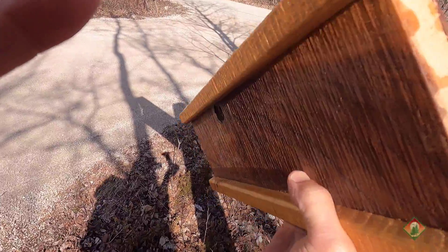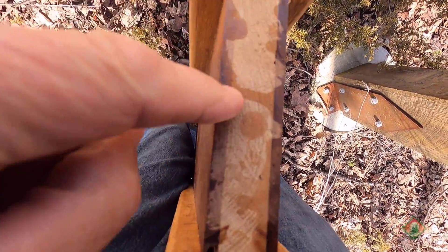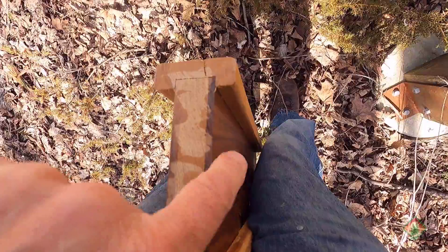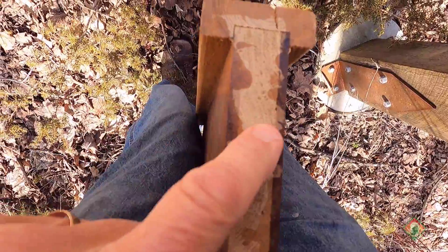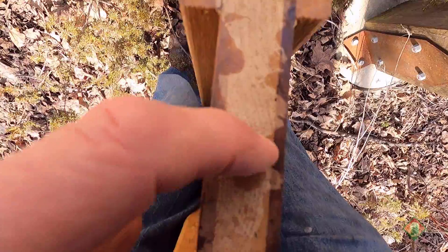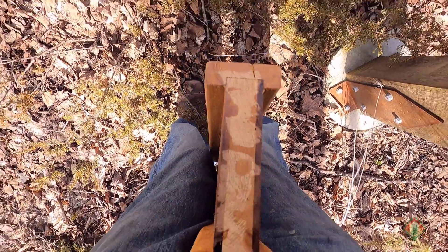Here you could use a cedar effect on this one. This is one where I did do a triple laminate. There's a black walnut on the outside — quarter inch black walnut — and then the inside was ash or cedar or something like that. But this could be done where the outside is quarter-inch cedar, and then on the inside would be treated wood, which would be ideal. I'm going to do these a little differently — not making the groove the same size as the piece itself. Instead, there'll be a three-quarter inch by a quarter inch groove, and then there'll be a shoulder — basically a tongue put onto this.